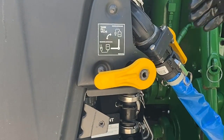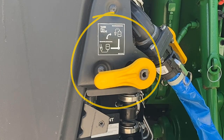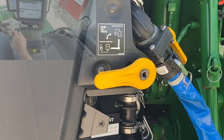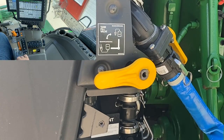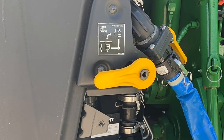Open the outlet shutoff valve. With the tractor tank fill valve in the transfer position, transfer the solution into the tender tank or approved container using the on-board transfer pump. Do so by placing the top or associated SCV control lever into the retract position to drive the on-board transfer pump.